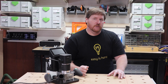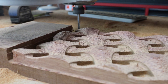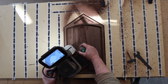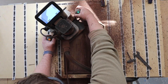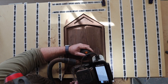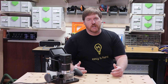But there are some downsides. You can't use really large bits, for example. The lack of 3D carving is a big issue for many people, including me. Even carving simple flat cuts with a hole larger than the base of the Origin can be a challenge, if not a bit dangerous. Also, the Origin requires more manual labor than a gantry CNC machine. Over the long term, it's slower — even with the less upfront design work on the computer and the smaller learning curve, you just can't outrun a gantry CNC machine running 150 inches per minute.